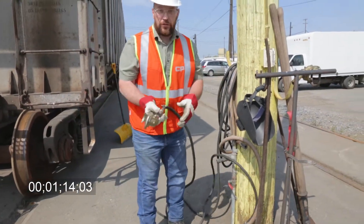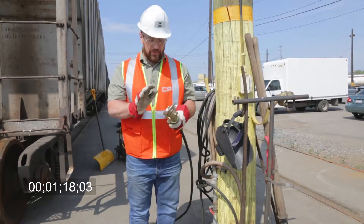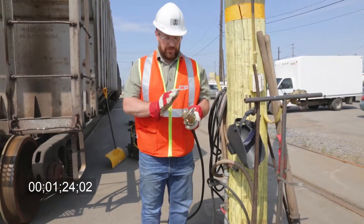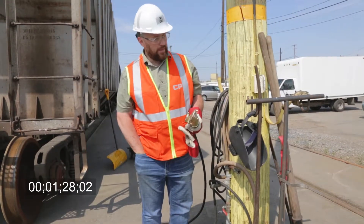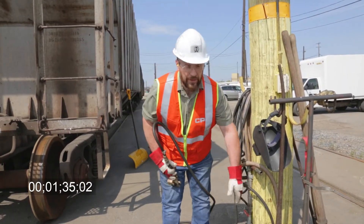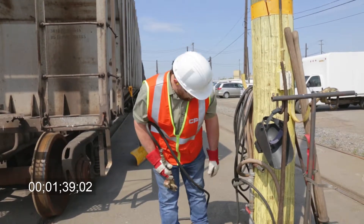The first thing we're going to do is ensure our yard air is blown out. The reason we're doing that is we don't want to introduce any moisture into the braking system. This is very loud, so for safety we're going to put in some ear plugs. Once everybody's clear, you're going to point this away from anybody and crack that valve all the way open to ensure all that moisture comes out of the train line.